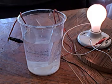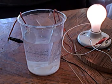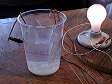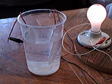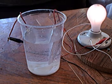Because you have an AC wave, it keeps alternating back and forth between positive and negative. Every time it goes positive, the oxide layer on the aluminum plate is going to block it. And since they're both aluminum, every time the wave flips, it just blocks it — it keeps going positive and it's never going to pass the positive current. So you basically have two diodes facing each other.